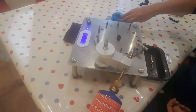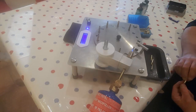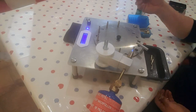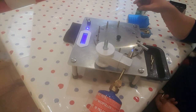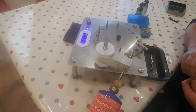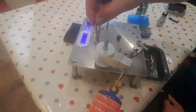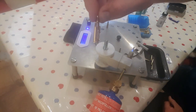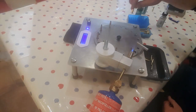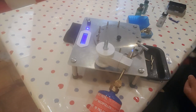We're almost at 50 cases and you can see how quick it is. It actually probably takes longer to set up the annealer and get the temperature settings correct than it does to actually anneal the brass itself. I'm going to pop another case on that has a little bit of temperature indicator on it, just to double check there isn't excessive heat travelling down to the case head.